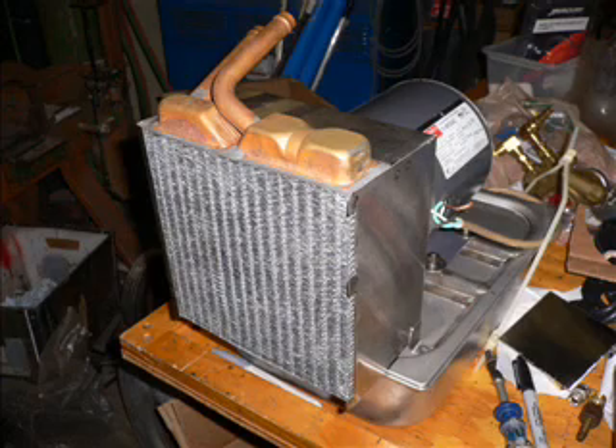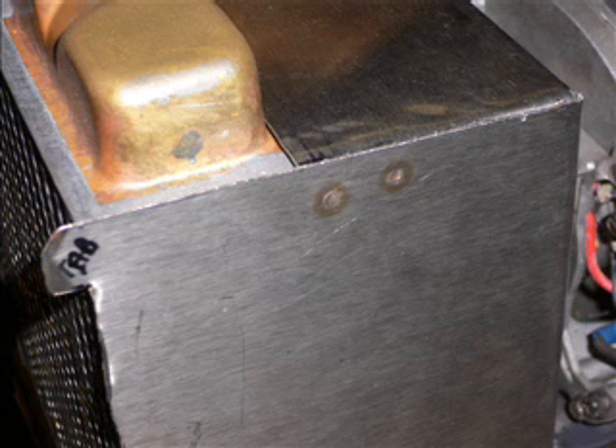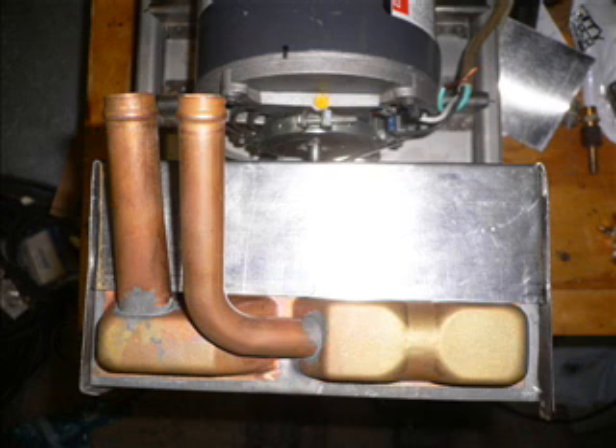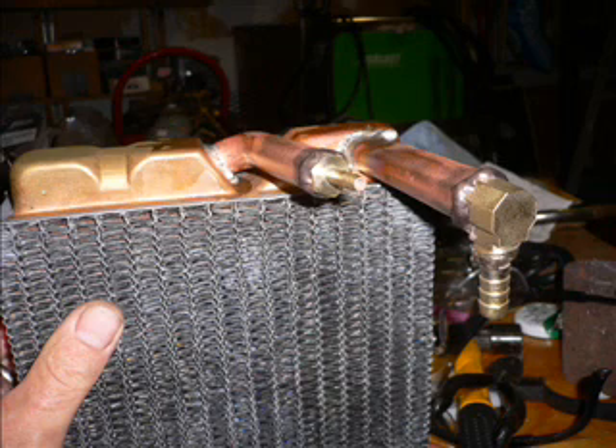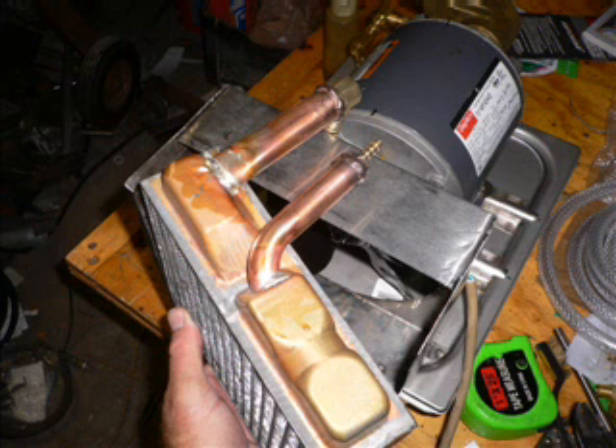This is the heater core out of a Chevy — it's in the parts list at the end. Those long tubes were too long and I didn't like the way they ended there, so they got unsoldered, cut off, and the ends I wanted were put on them. I just brazed them on with some air conditioning type brazing rod, then moved them down and re-soldered them in. The soldering on this stuff is so thin and easy — you can hit it with a propane torch for about three seconds and it's already melted. This lowered them down to where we had more clearance, because I didn't have a lot of room on my cart height-wise.